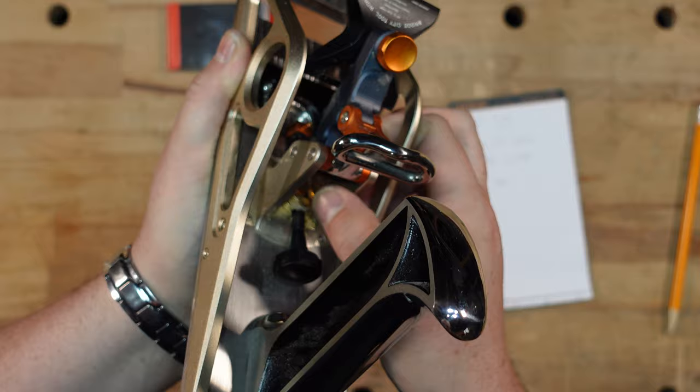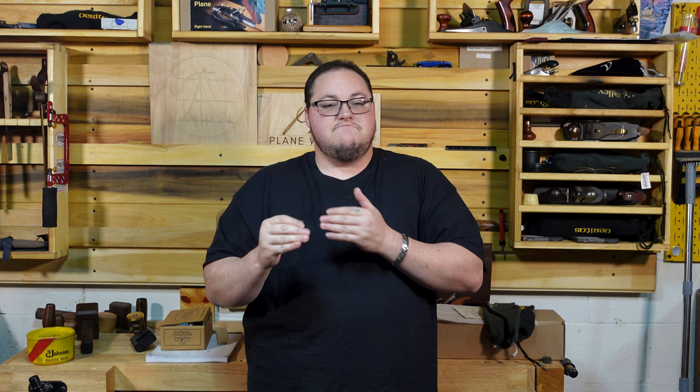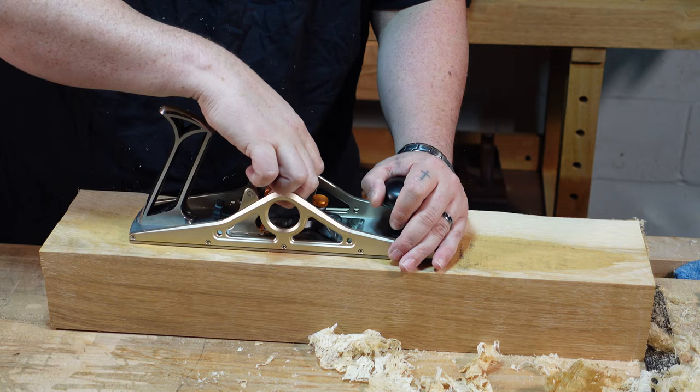Diving into the things I don't like: I don't like that Norris-style adjuster — I'm 99% sure it's plastic, so it makes me nervous adjusting it. The lever cap looks cool, but they missed the bar a little bit because I can't undo that cap very easily. I'm pretty strong and it was taking real effort — I was worried I was going to break it. You have to loosen the screw of the cap and then lift it up, which defeats the whole purpose. The lateral adjust is so smooth that if the cap isn't tight enough, it goes all the way to the side.